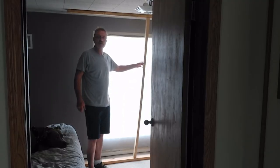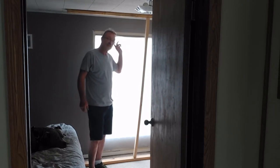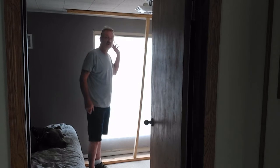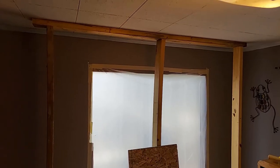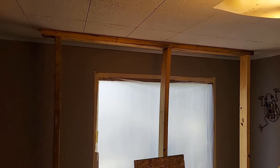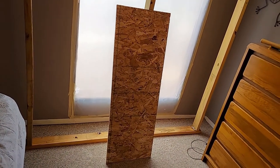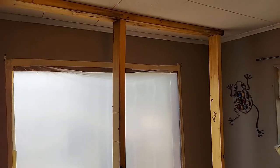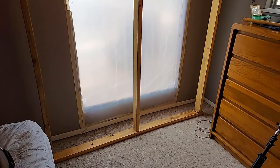I'm going to build a temporary wall — probably four two-by-fours, one across the top and some little pieces at the bottom for those two-by-fours to sit on — screw it into place, and then we'll be ready to go. Even though this two-by-four is far too long and needs to be trimmed, it is successfully holding everything in place. I'll go cut the correct length two-by-fours and get a couple of them in. I'm going to take this plywood and screw it on up here and let it hang over the end.